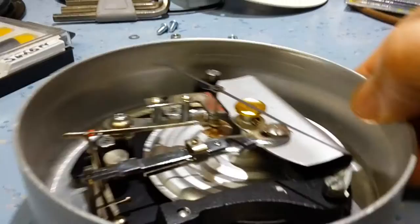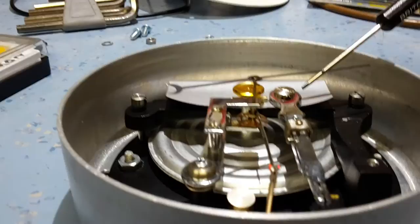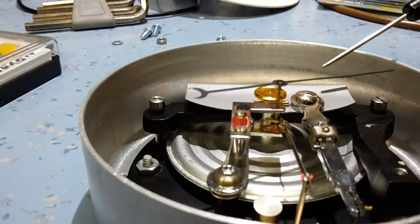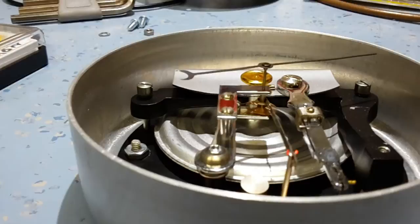What that's doing is: if that pin isn't there and that spring isn't there, because the bellows are under a vacuum, the air pressure will just crush the bellows and they'll be squashed totally down all the time. So you've got to compensate for the air pressure by using this big heavy spring here that will pull the bellows apart. Otherwise, there will be no deflection in the bellows with air pressure change. Basically, that spring is stopping the bellows from collapsing under atmospheric pressure.